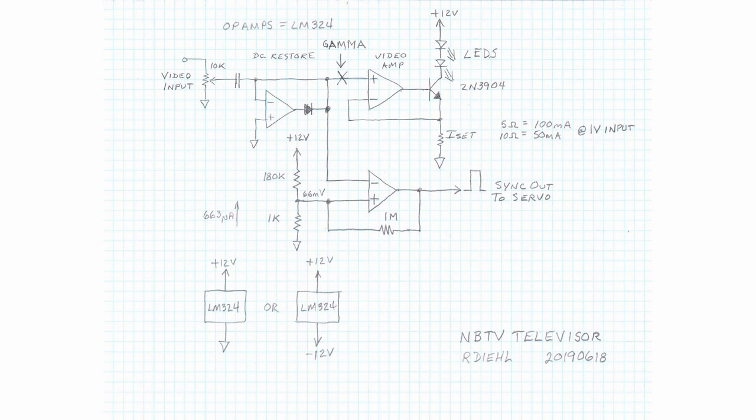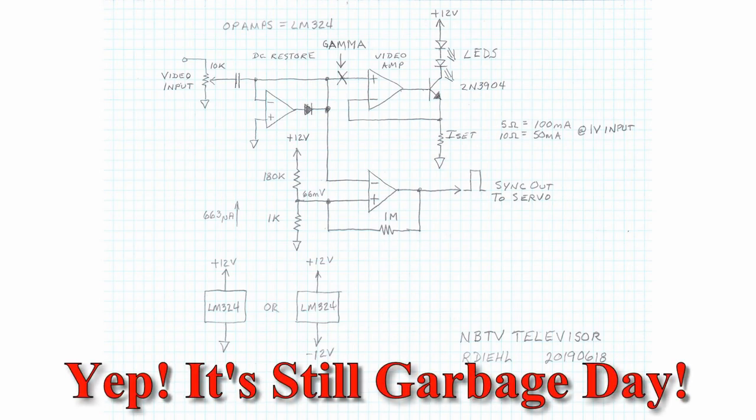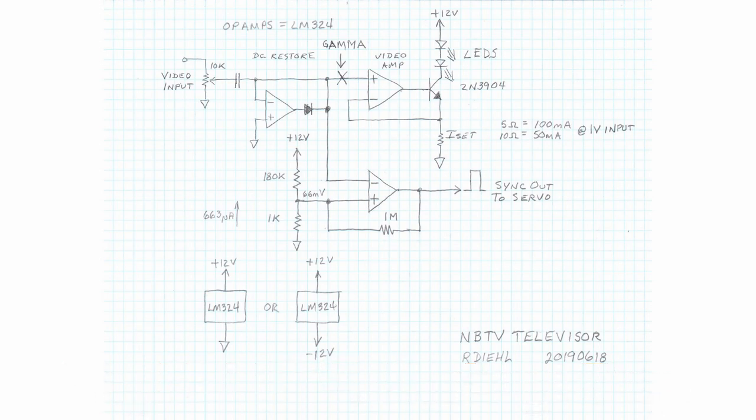Note that the resistor values I give — a 5-ohm resistor will give me 100 milliamps into my LEDs if the pot was dialed all the way to the top. By selecting the ISET resistor, we can set the top current for peak 1V in to give us whatever maximum current we want for our LEDs. That summarizes my version of the circuit. My sync separator currently is their sync separator. I'll use that until I determine it needs improvement, because it's on that side of the level control — though perhaps that makes sense when you have unreliable sources where the voltage waveform can be anywhere from a tenth of a volt to 3 volts.